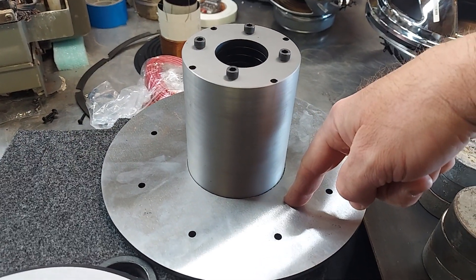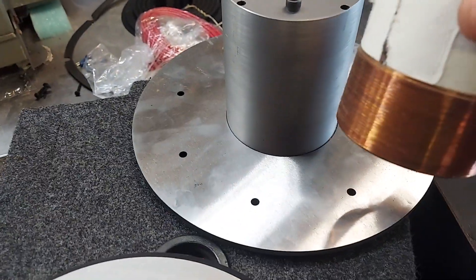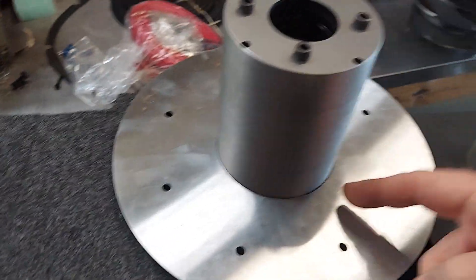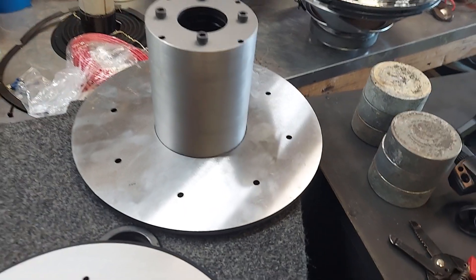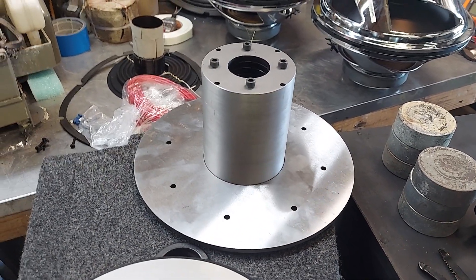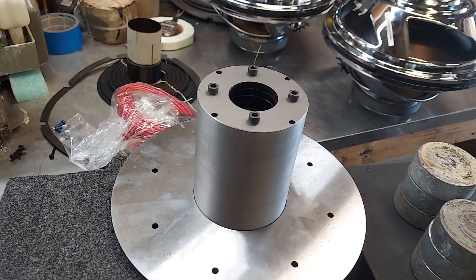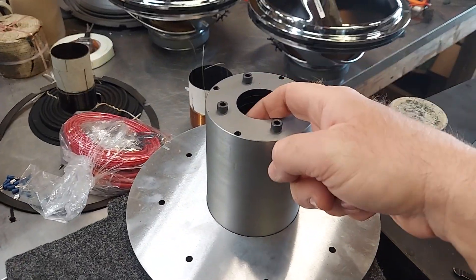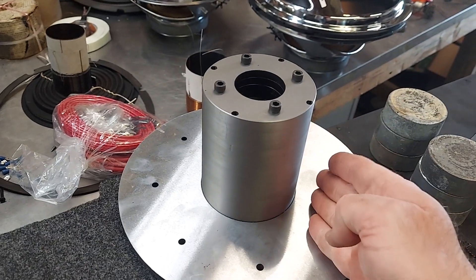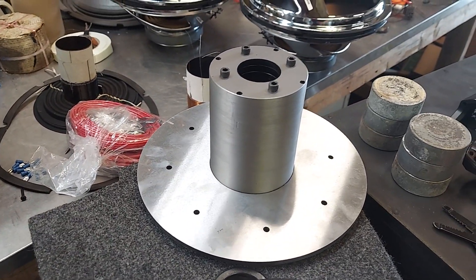In a really high-powered motor like this you really want some sort of heat shield. I wanted to go the extra step — basically a coil of quarter-inch copper tubing that would wrap around with an inlet on the bottom and the outlet underneath the top plate, using quick disconnects. Then you'd use a little Arduino or Raspberry Pi to monitor temperature and accelerate or slow down the flow of the fluid through the heat exchanger. You'd have a temperature sensor right inside the coil and another on the outside of the heat shield to measure the difference.